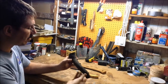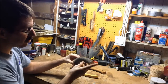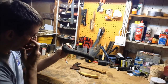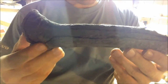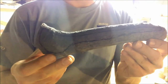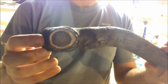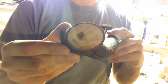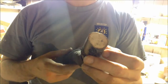To speed the process up a little bit, I just used a saw to remove some of the excess here, and part of the knot, and the end. I've drawn a vague outline of the spoon — I don't know if you can see it with the light behind. Of course, this will be in three dimensions, because the handle is going to be wavy. There's a contrasting colour here where the knot was that may be kind of neat. It looks like we've got a nice dark centre, so maybe we'll see some of that come out in the spoon as we go. So let's start whacking away with the hatchet and removing some material.